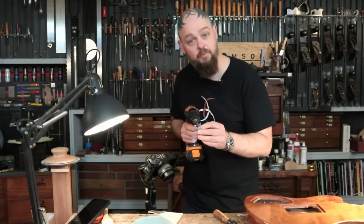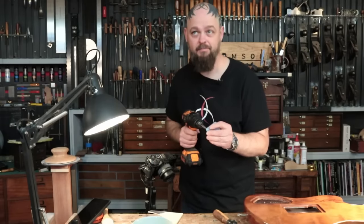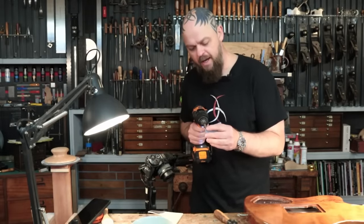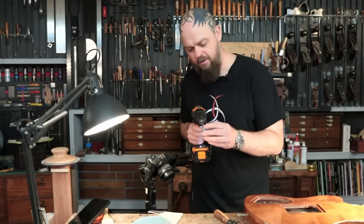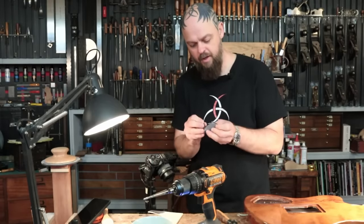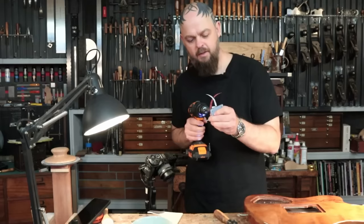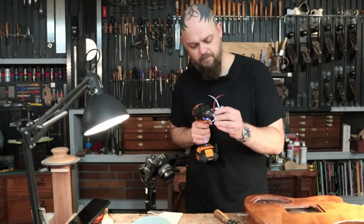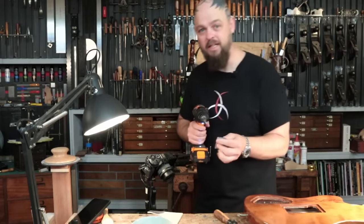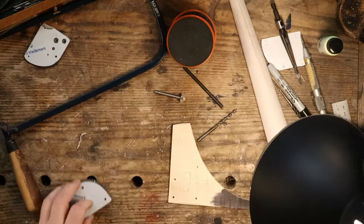Based on what happened last time I'm going to film the whole process just in case this one breaks too. I've run out of battery. So the thing with the reamer is it's gently going through and slowly enlarging these holes without much danger — and yeah, this is the way. I could probably do with some sort of locating device on here, but the hole does not have to be precise to within half a millimeter. Done — a few tests, used a few different countersinks and nothing broke.